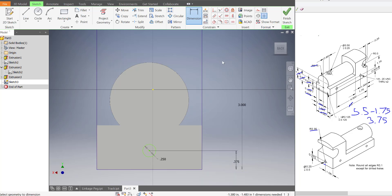And from the bottom to here is 0.375 — that's the height. Now the radius of 2.35: the only way we could have a radius of 2.35 is if we had a circle of diameter 4.7, because we double this number to get the diameter.